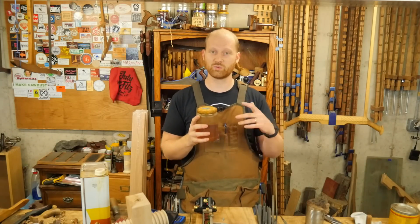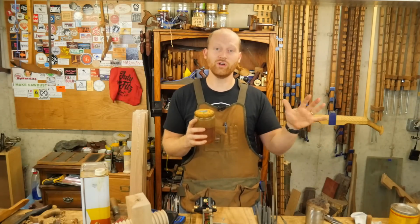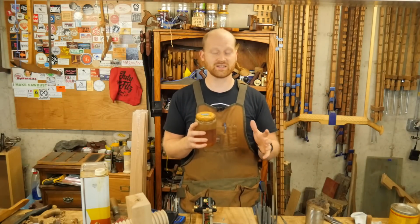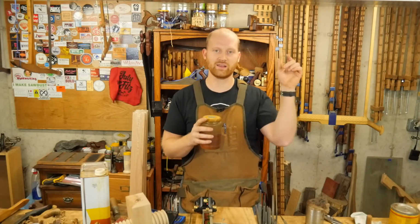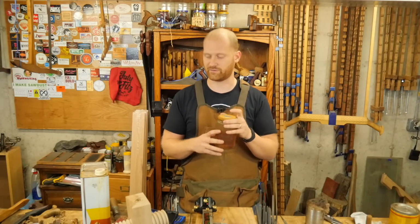But there are places where you can buy raw linseed oil, and that will cure over time. It just takes a very, very long time for it to fully polymerize. There are also places that you can buy boiled linseed oil that is natural, and I'm going to try and leave a couple links to those in the description below. I've had a lot of people asking for that.